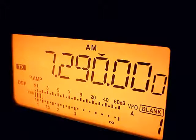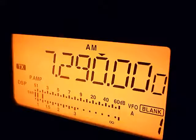So who knows? You might even set up a QRP rig off the front of your truck, and we'll do a little AM. The frequency I told you on 15 meters was 21445. It's right below the threshold, about 5 kc below the upper portion of the band where almost nobody is. So I think that'd be a good spot to do AM. It's a little bit wider than sideband, so you don't want to annoy anybody doing it in the center of the band. But up there at 21445, we should have the band to ourselves, Kevin.